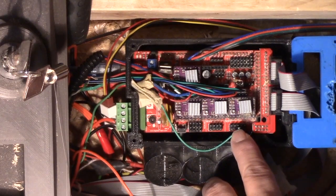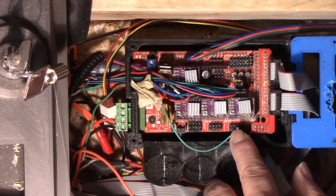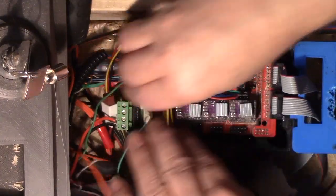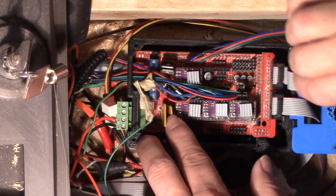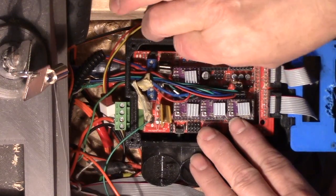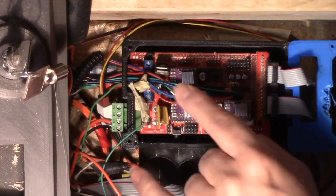This wire that fell off nicely is the wire that controls the laser. I forget the exact pin number — I suggest you look at the other video for that. That did require a change in the code: I use the fan speed to control this PWM output, so there's a code change involved. But let's ignore that for now. Here are these two large components — some instructions say they should be separated and not squished together, so I've got them nicely spaced apart.